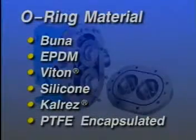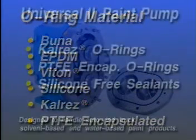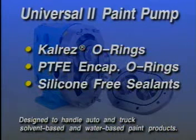Before beginning to disassemble the pump, check that you have all required replacement O-rings and that the O-ring material is appropriate for the product to be pumped. Maintaining the popular Universal 2 paint pump, for example, which is especially designed to handle auto and truck solvent and water-based paint products, is virtually no different than the standard Universal 2, except that O-rings are Kalrez or PTFE encapsulated and sealants are silicone-free. You'll see these installed in the course of the video.